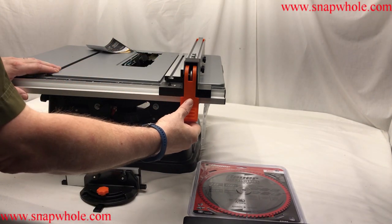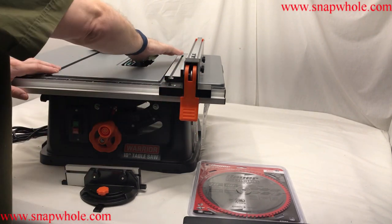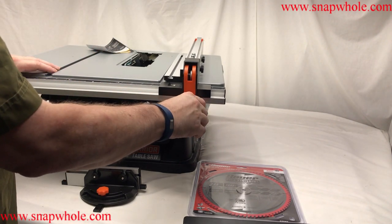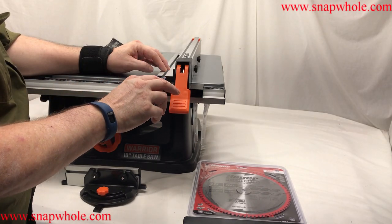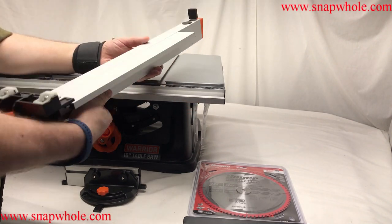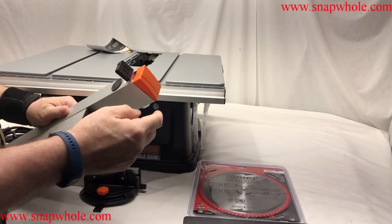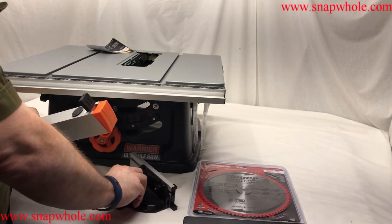The worst thing about this saw is this. If I clamp it down and I push, it gives. You see, that's locked and it still moves around. On the original one that was broke, it didn't have this problem. So we've got to adjust that somehow. If we take this off, this bar goes against the back. It's got this cover. I've got to pop that cover off and there is an adjustment screw in there. So let's take a look at it.